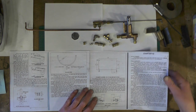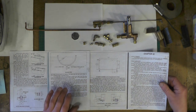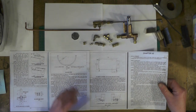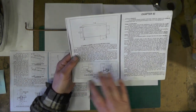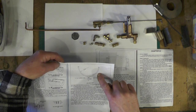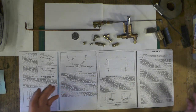Let's have a look at this pipework first. When you look at people's locos and see all the pipework on it, it looks a bit daunting sometimes — like spaghetti junction with pipes going all over the place. It looks complicated, but I think when you take it step by step and have a look at the drawing, especially on Sweet Pea, it's not that difficult. You've mainly got 3/16" pipe for most things, except the whistle pipe is 5/32", the blower pipe is 1/8", and on the tank side you've got a balance pipe that's 1/4". So those are the four sizes.